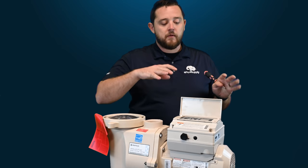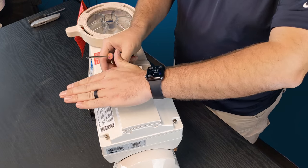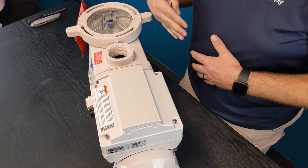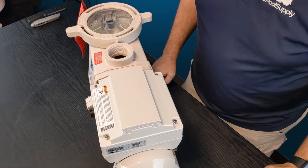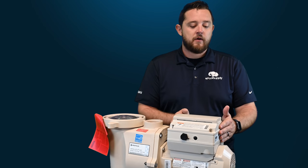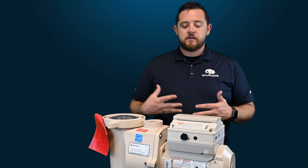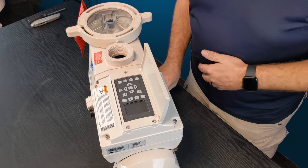They also provide you with the ability to relocate this entire panel. If piping comes directly across and it's not easy to lift the lid, instead of hacking out all the PVC and re-plumbing, you can actually buy a separate piece — which we should have available in the links in the description — that will allow you to take this off. It's basically just an extension: they give you a plate that will cover the back of the pump so everything stays watertight and sealed, and then you can mount this entire panel to the wall somewhere easier to access. The power will run from that directly to the pump, which is especially helpful for those of you that do not have automation.